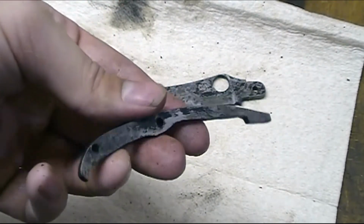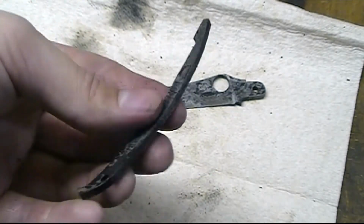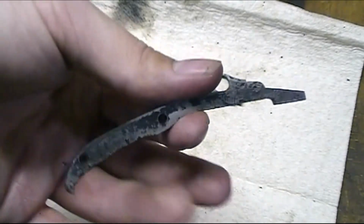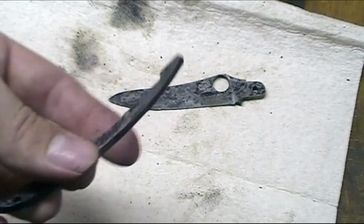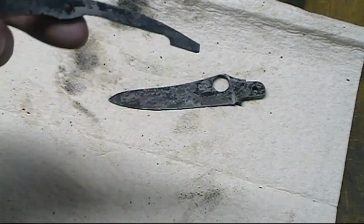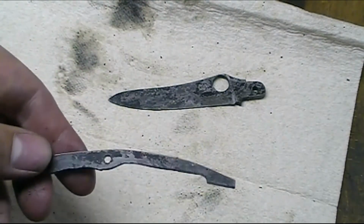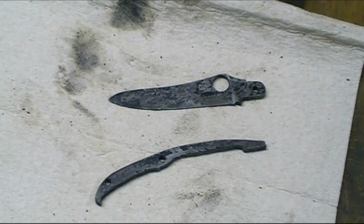And then what I'll do is go ahead and clean it up with sandpaper on the grinder and everything, get it into a nice satin finish again. They're not a satin yet, but I'll get it cleaned up so I can see clean steel. And then I'll take it back to the forge and have the burner going real slow. And I'll just run it in and out of the flame and work a nice straw blue kind of color, almost what the Dykem layout fluid looks like on steel.